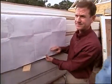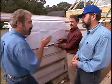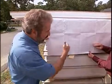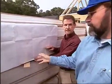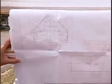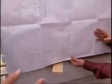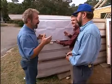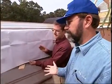Yeah, exactly. Because Frank, what you guys do is you take the architect's plan. In this case, it's a plan that shows you the exact location of every post and beam and rafter in this structure, and you mathematically figure out what the layout is for your panel system, right? Right, we look for the optimal layout here to minimize waste and also to provide the structural engineering required in the structure, and in this case with the post and beam, trying to make those panels lay well onto that frame. Right, and so we're looking at a system where you really don't have a series of 2x4 studs on 16-inch centers anymore. You've got the structural strength, in addition to the post and beams, right into these components.